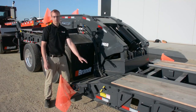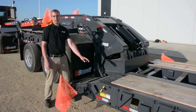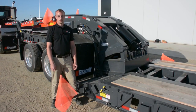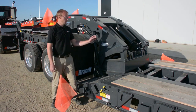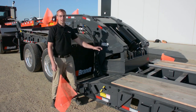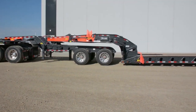We have a pin retainment system that is simply used for anti-dive — it does not mechanically fasten the trailer in any way. Our anti-dive pin system has been designed so that it is easily repairable should it ever become damaged because of improper operation. If your operator is on site and he bends the end pin, there's a short bolt-in piece that he could swap out with a spare — light enough to conveniently carry in the cab of his truck — replace it, put it in, and then he can get back on the road quicker.